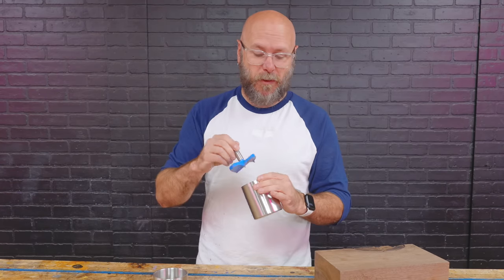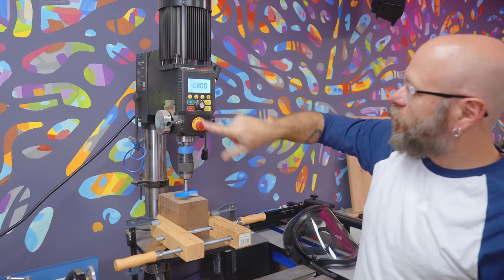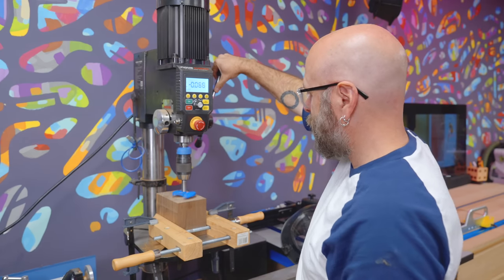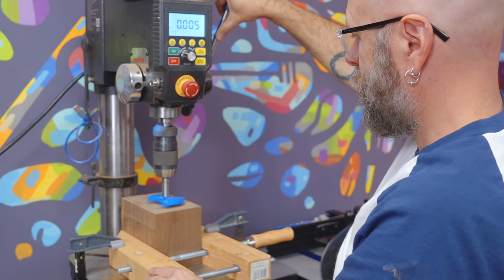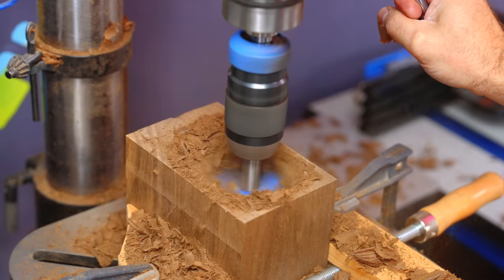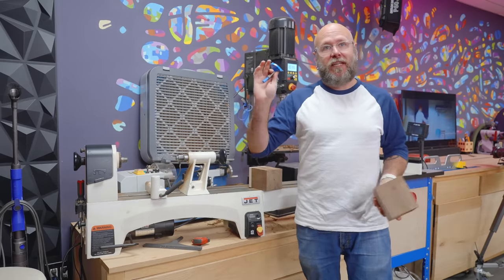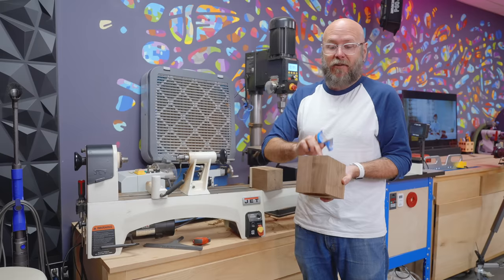The other ones are a little bit more difficult. I got this chucked up in the drill press, we're going to slow the speed way down, and we just drill until we've drilled enough. That didn't look, feel, or sound good. There was a lot of chatter, and I'm not sure if it's just a cheap bit or if the chuck wasn't in the drill perfectly straight.